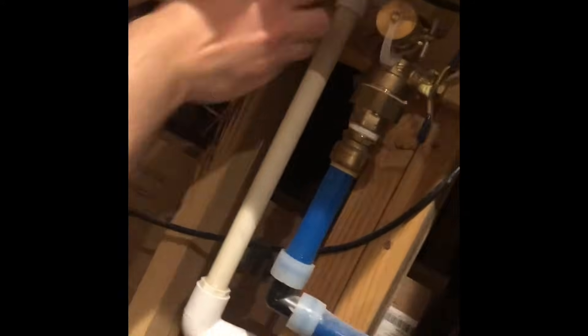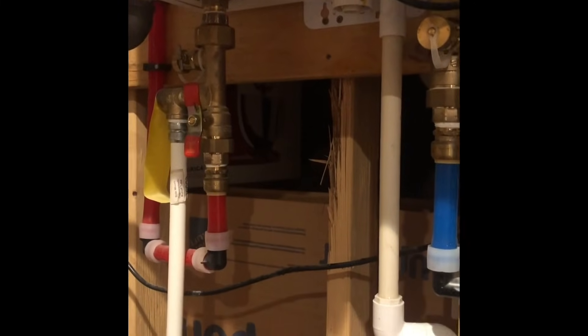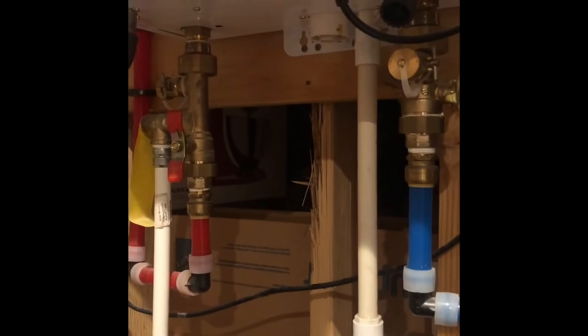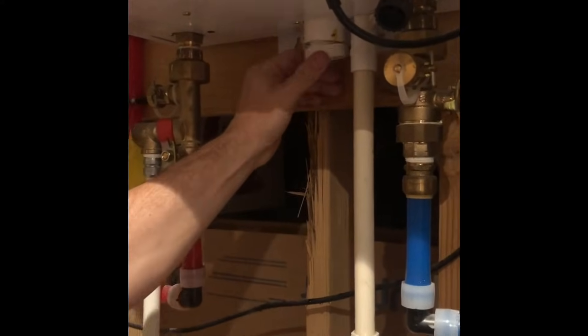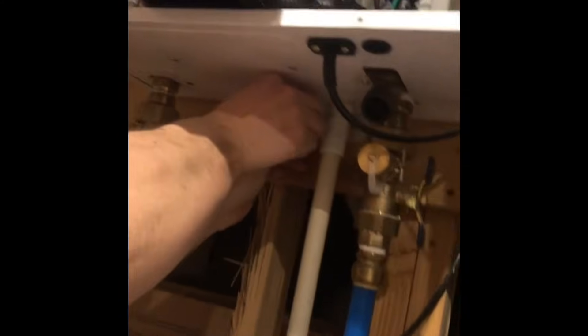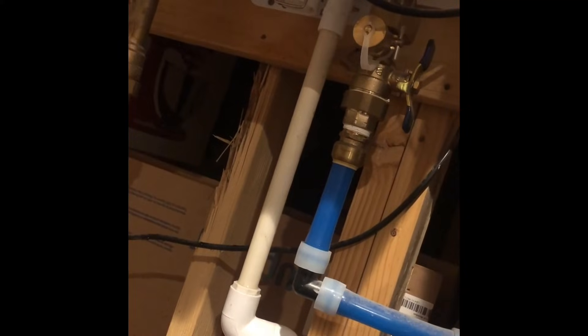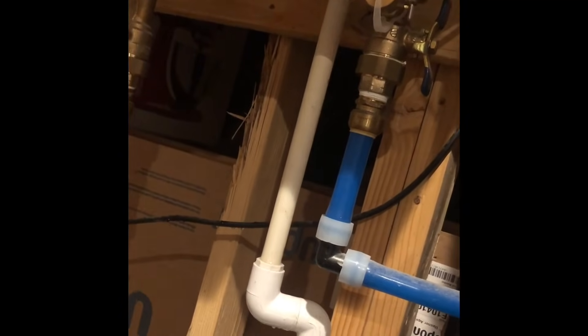This needs to be drained — it's a condensation trap. You're going to pull that out and drop it. See, it's filled with water right now. I think that's because there may be some condensation getting into the pipes up on top of the roof. So you're going to have to drain that. Once I did that, it was able to reset and we're getting hot water again.